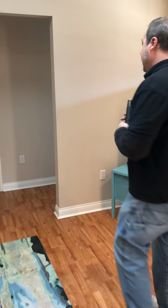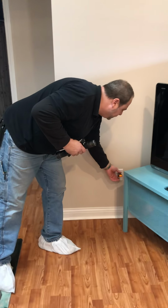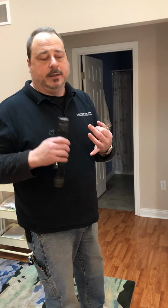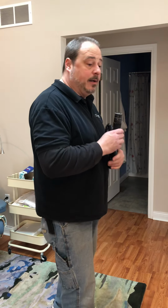They're all insulated in the roof as well, or in the attic space. So it's a little difficult to see in the attic space for any kind of leaks. You would just want to look around the top part of the flashing for leaks. In the rest of this area, I am checking all your electric. So just like we had in the kitchen, plug in the small little tester to make sure we have 2 amber lights. Anything different than that on this tester would reveal reverse polarity, open neutral, open ground, reverse hot. And I didn't see any issues with any of the electric inside the house. And no other water stains in this area for the living room either.